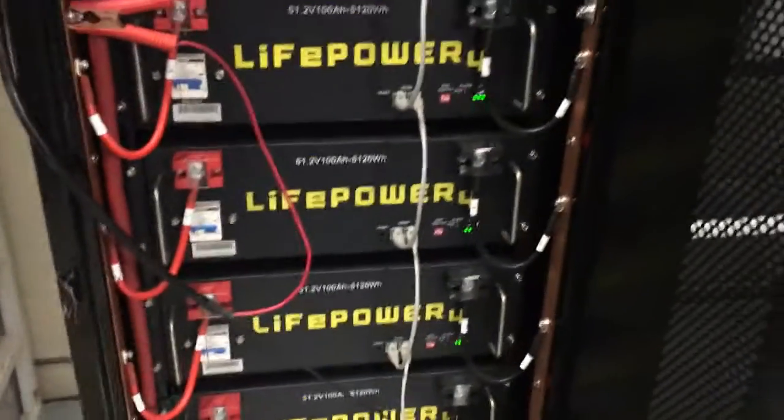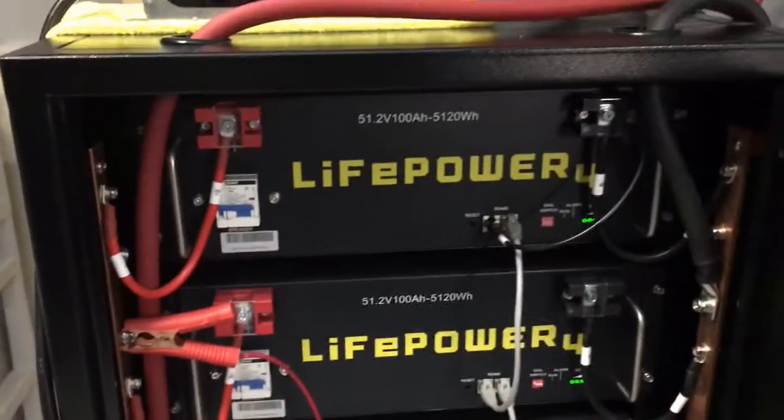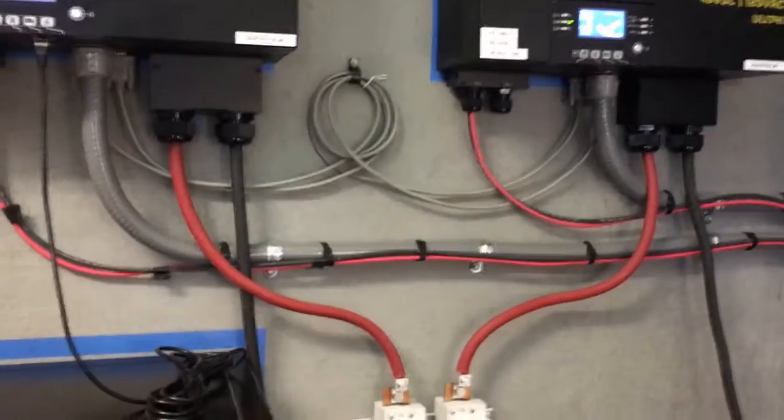I had to put some tape here because I can't use the lock. Attend to your situation — if you can do this safely, keep it like that. In this case, I have it hooked up positive to positive, negative to negative. Before you hook this charger up to your batteries, make sure you shut everything down. Then you can go ahead and turn your system back on — turn your breakers on. The top one runs everything, so start with that one, then work to the next one. Turn your solar panels on, breakers on. Then push the buttons for your inverters once those kick in. So: breakers, batteries, solar, then inverters.